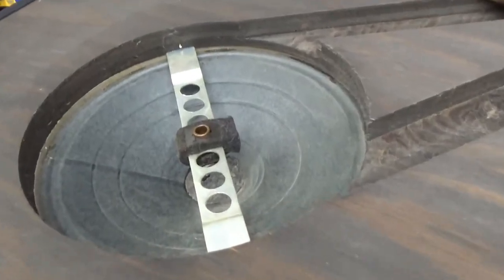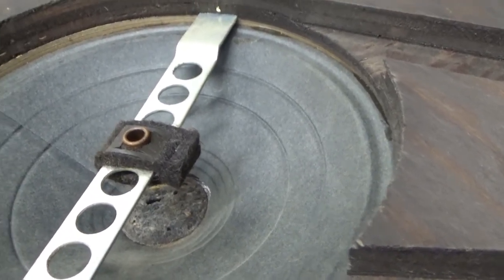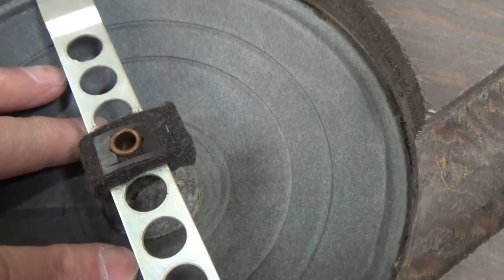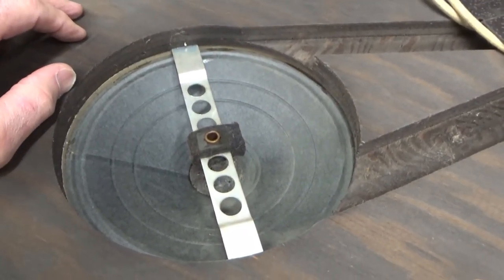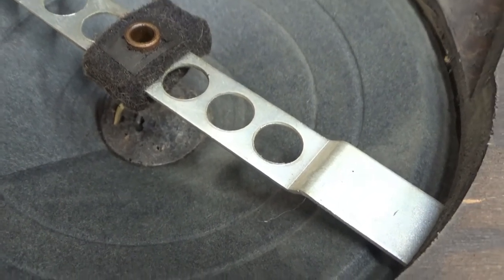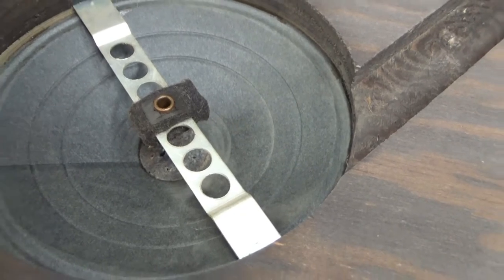Got the squirrel cage removed — that's definitely making some nasty rapid noise at lower frequencies. About 125 Hz is where it really shows up. What I've noticed is when I manually move the speaker, I get some popping and snapping from the voice coil area. I don't know if the voice coil is rubbing or if some of that deteriorated dust cover has fallen down in there, or maybe it was from the mice eating at it. I guess I'm going to have to replace the speaker or maybe try to re-cone it.